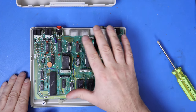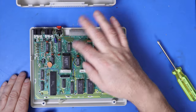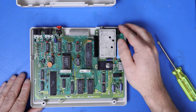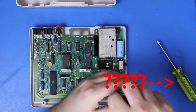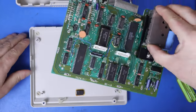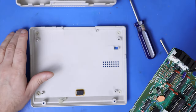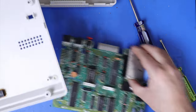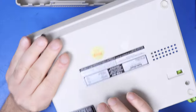It's got the 8K in here. I did have to do a repair where one of the lines should have been grounded — this line right here — but it was actually not, so it caused some problems when I put the expansion cart on. Now I've just got to find a screwdriver. There you go — it's just three screws: here, here, and here for taking the motherboard off. You can see the screw that's held in by the sticker there.